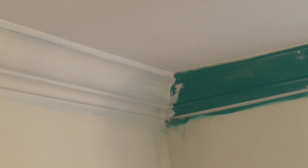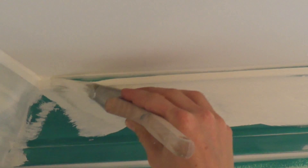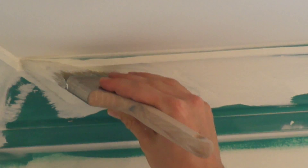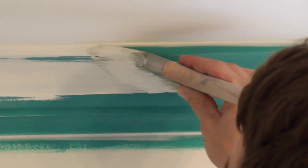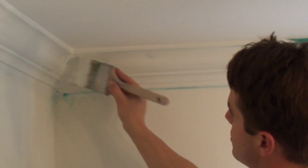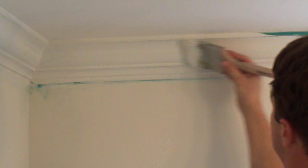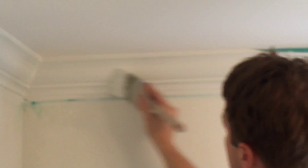I'm pretty happy with this. In the corner I'm going to load up again, come back, grab it, work it into the corner, and pull across. I'll load up again, turn the brush around, come over with it, come back, work it into the corner. Then just a light swipe, turn it around, and now feather off the wall there.